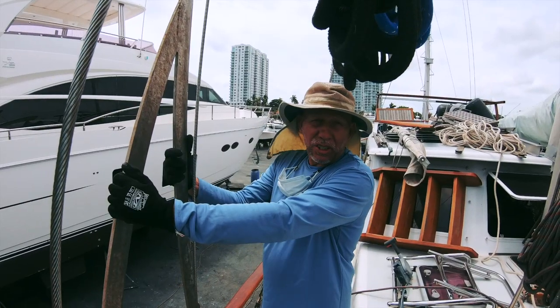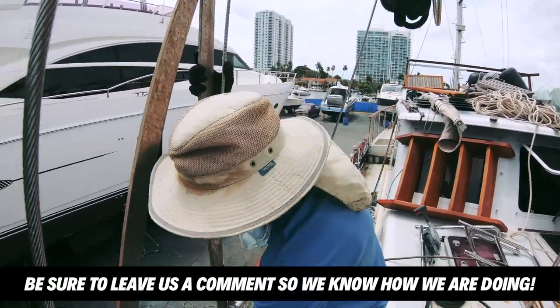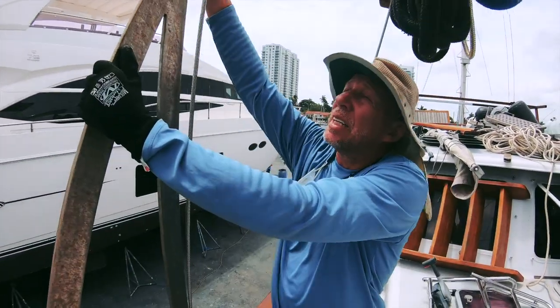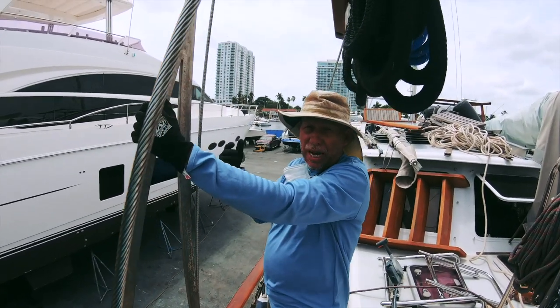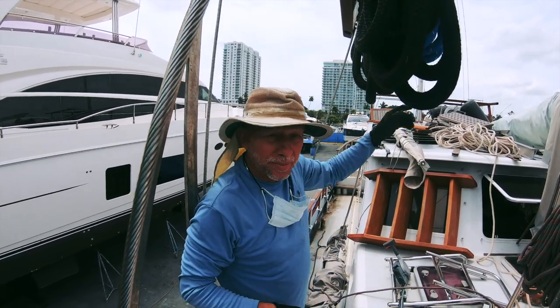These are fabricated so you can lower the main mast by extending the point from the lower position to the upper. I'm going to use these, tie them in with a turnbuckle, and connect to the center of our mizzen mast, so as we're lowering it, we've got support at the top and at the middle.